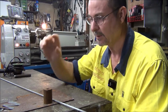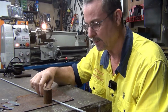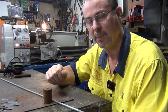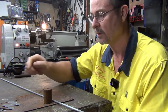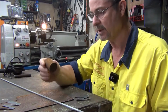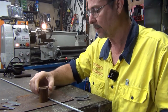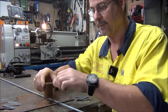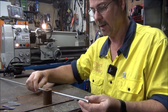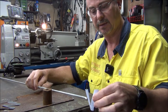So what I'm going to do is a retrofit, because I don't have to unbolt it off the roof. I'll retrofit a part that'll slide over the top, and you tighten it up with a grub screw just to hold some of the letters on there. I'll make it out of a piece of mild steel, so it slips over the shaft, with a grub screw to tighten it down, and I'll have these parts here, on four spots with the letters on there.